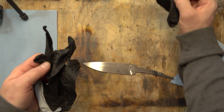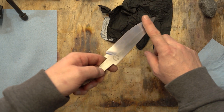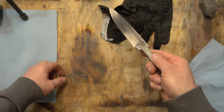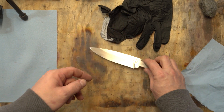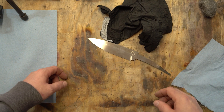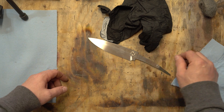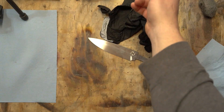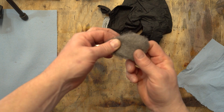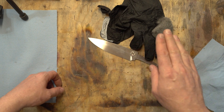I use gloves mainly because when I'm scrubbing with steel wool between dips I don't want to get fingerprints on the blade and risk them acting as a resist for the ferric. You can do it without gloves — the ferric isn't really an acid, it's not going to eat your fingers, just don't leave it on your hands too long. You'll also want four-aught steel wool — the super fine stuff — and some Windex to clean the blade between dips.